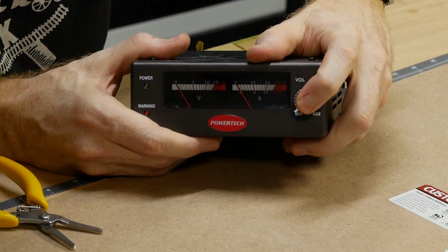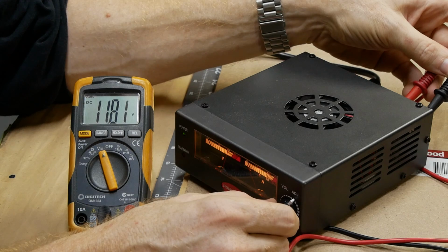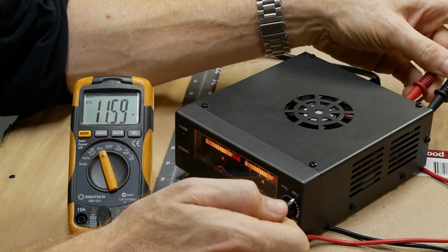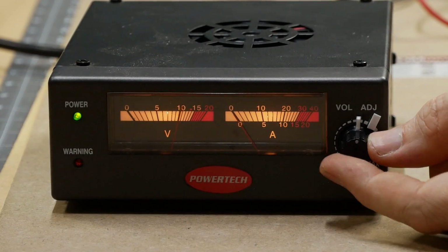With the knob attached, I turn the unit back on and set the voltage. I actually used a multimeter to be exact with the voltage and set it to a value just a little under 12 volts, which is the max for the LEDs I'm using. Then a small piece of styrene is used as a stopper and glued so the turning knob can't be rotated past it.